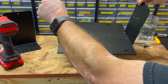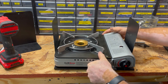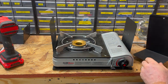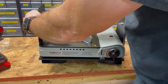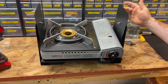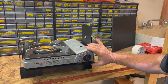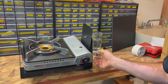All right, we've got our bracket on and we'll set the stovetop inside. Our next step is going to be to attach these other bookends so that the entire thing can swing. And there we go — we have a stovetop on a gimbal. You may have to take a few tries to adjust things so that when there's nothing on the stovetop it's perfectly level. This one's leaning forward a bit, so I'm going to slide the location where it's attached to these brackets forward just a bit.